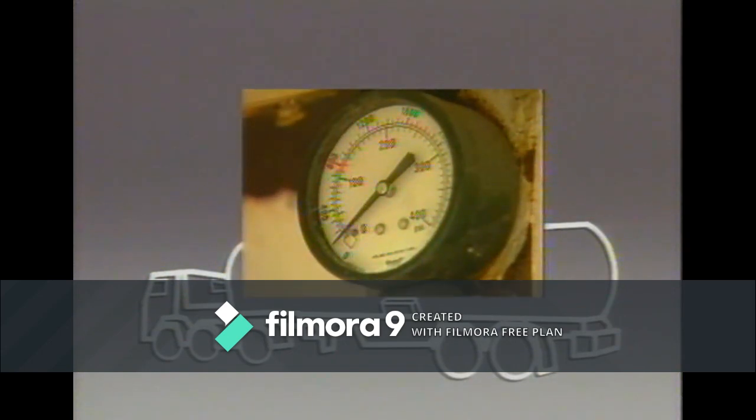The various pipes visible inside relate to the exterior fittings. These fittings vary from one vehicle to another, but they can generally be considered under the headings of instrumentation, product transfer equipment, safety valves, and a manhole. The instrumentation generally comprises a pressure gauge, which is connected to the top of the tank, although the gauge itself is fitted lower down for easy visibility.